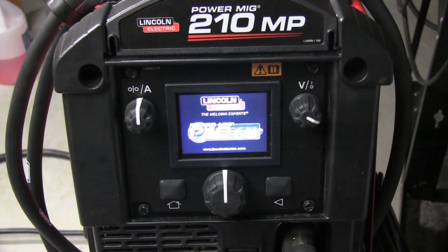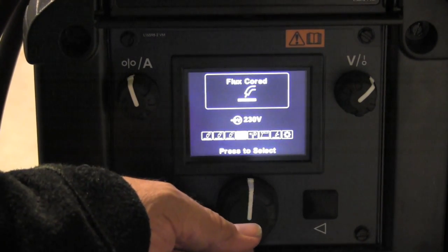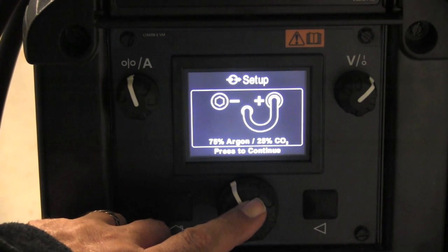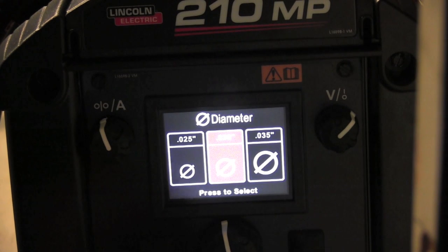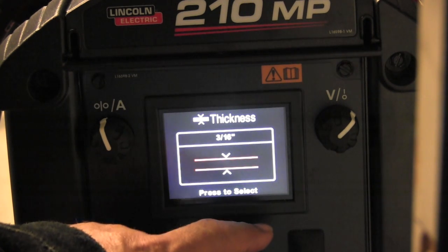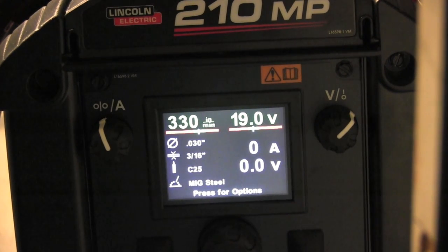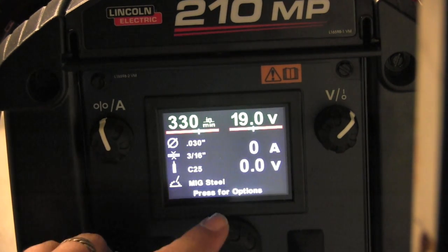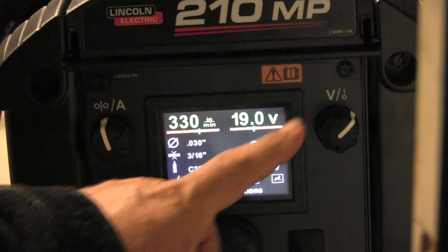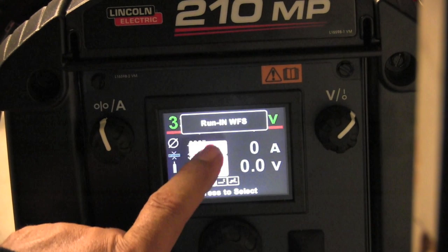Let's take a look at the MIG settings and extra features real quick before we light up on MIG. Hit the home button and it takes you back to all your process selectors. It's got one for MIG steel C25, then it reminds you to check your polarity. Press continue and select your wire diameter. Every time you select something it takes you to the next series in the menu, then you've got thickness — you can select one and then adjust manually after that. I'm selecting three-sixteenths and that throws it into 19 volts and 330 inches a minute. That's high on the wire feed speed, but it does get you in the ballpark — workable. You can manually adjust both voltage and wire feed speed from there.